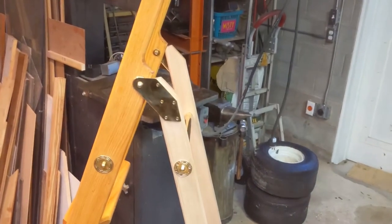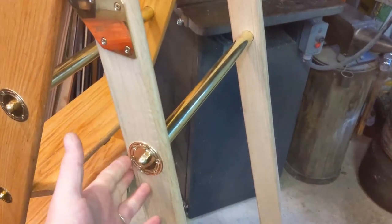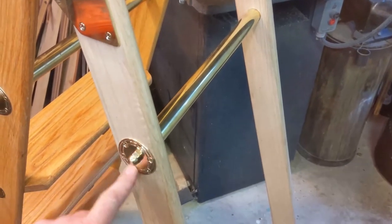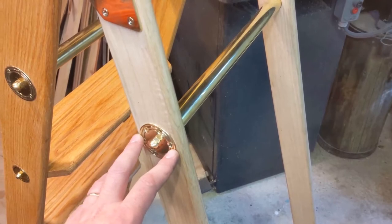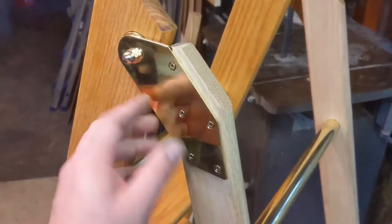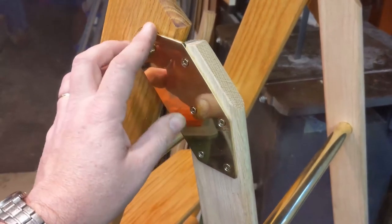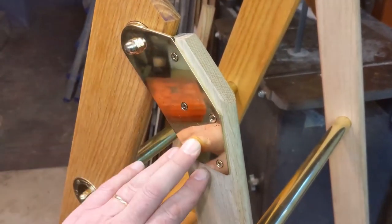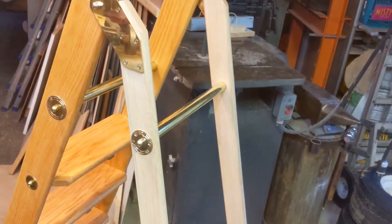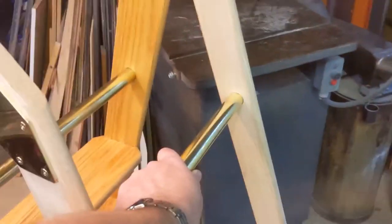A little bit of time has passed, and here we have the ladder for the first time in a standable configuration. The folding brace is made with the same basic methods and materials as the first part — drilled through here, counterbored the place for the brass plate to set in, used the mill and the DRO to drill these holes in a radial pattern. The hinges are just heavy brass plate — eighth inch brass plate — cut to size on the bandsaw, sanded down on the big sander, and then polished. And then the fulcrum pin going through what was already prepared. Final step: I'll get some finish on this so it can be setting up, and I will build the platform that's going to ride right here.